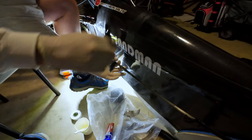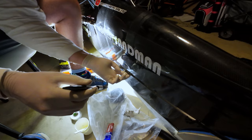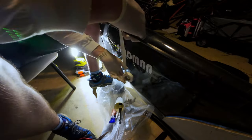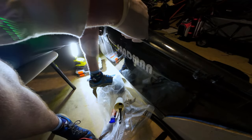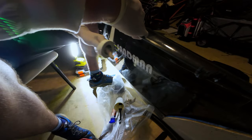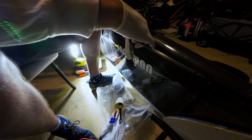and cost. So I ended up with a few offcuts because during lockdown I built myself a little European sailing canoe that I haven't finished yet, but I thought that'd be perfect for this job. Then I was able to just wrap some insulation tape around it, inside out with the sticky side out, which gives a nice surface finish to the part, and I didn't have to stuff around setting up a vacuum bag.